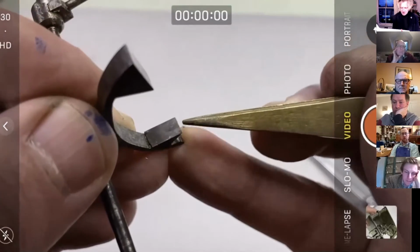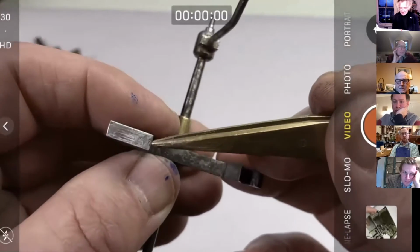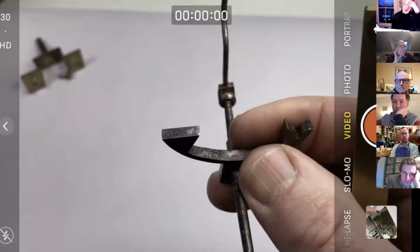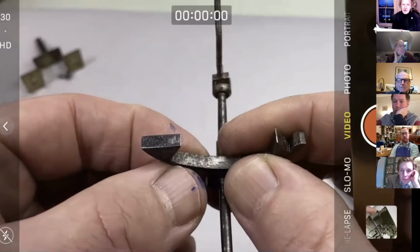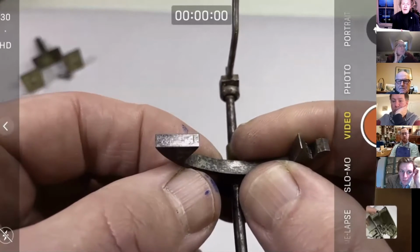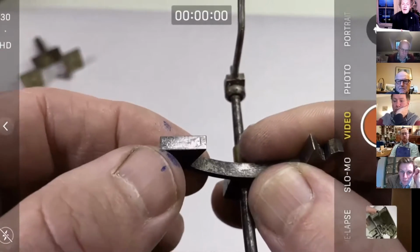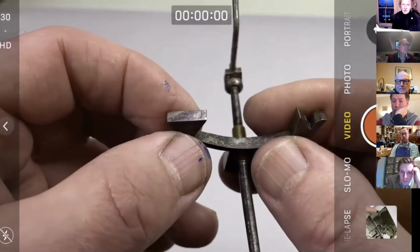There's a little sort of witness mark, but the entry pallet here hasn't. It looks shiny because it had some material on it which I took off for this demonstration. In fact, under there, you can just see in the light some wear mark from the original pallet face. So it's a bit of a shame if this is actually being cut back to polish out wear or something, but you know, who knows? We don't know what's going to happen there.